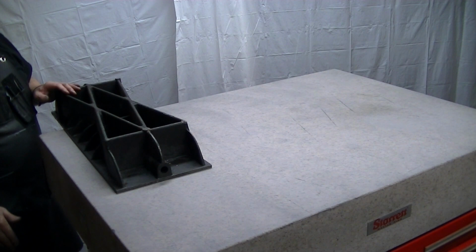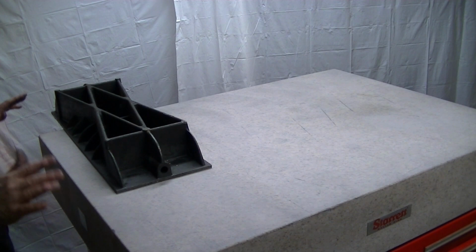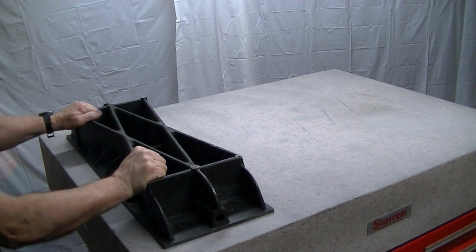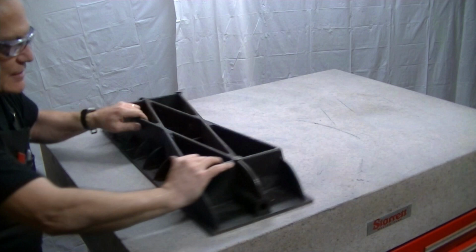It's just the nature of gravity overhang. You're getting more pressure over this edge because the center of gravity of this is moving towards the edge. If I come all the way over, I've got the full weight of it balanced here, almost no weight here. So that is just a given in lapping. Upper part is going to get concave, bottom part is going to get convex. To counteract that, you can do this, where now you've got your cutting action. This is getting all the cutting action, zero surface footage here, maximum out here. So you'll see guys spin the plate, and that's what they're doing. They're working the outside edges so that they get them to wear down also.